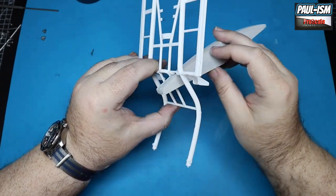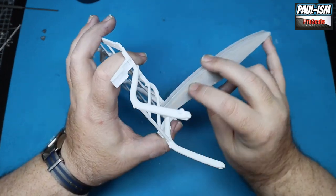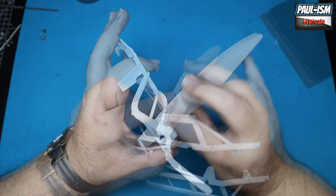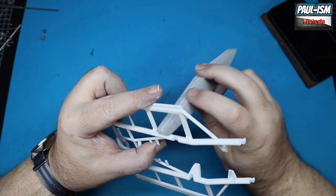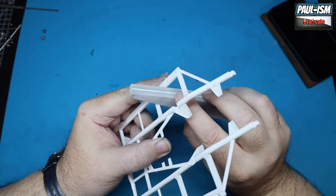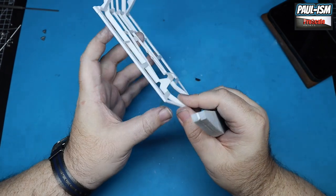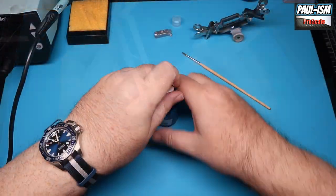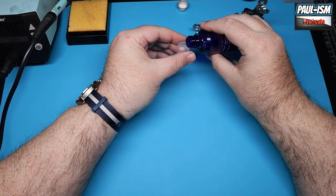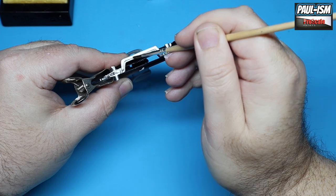But we're going to clean up all the seam lines. There's literally seam lines across the whole chassis. So this, again, was another hour or so, probably 2 hours of sanding. It was at least a day of cleanup here, getting all these parts cleaned up. It is dirty, messy work. Even though the parts have been through a tumbler, once you start filing and sanding and drilling, you end up getting covered in the fine powder of white metal. So gloves are a recommendation. There's at least 2-3 hours worth, at least half a day of sanding there to do.